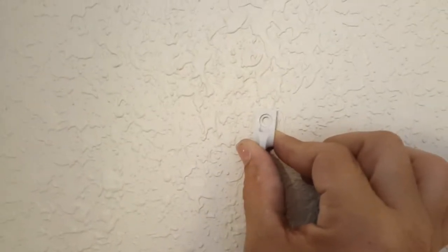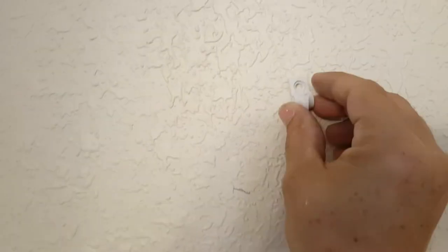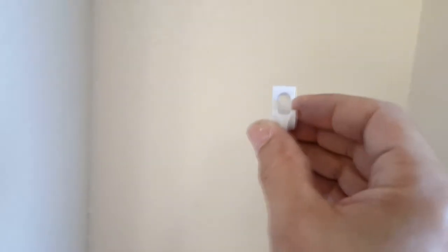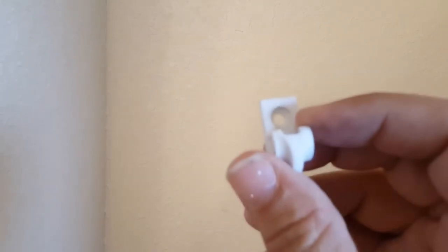The way we're going to attach these to the wall today uses a couple of different parts. This first part is the wall clip — it gets screwed right onto the back wall and is meant to receive the back part of the wire shelf; it'll snap right in. I want you to avoid using just anchors into the drywall. Put your screws right directly into the studs. We know there are two studs in here, one on each side, and that's really the best case scenario.